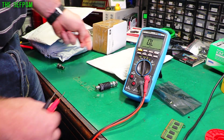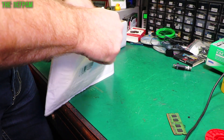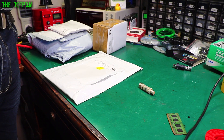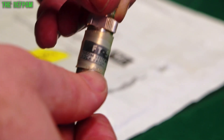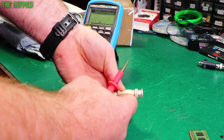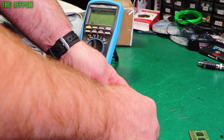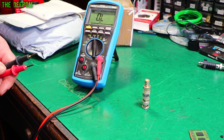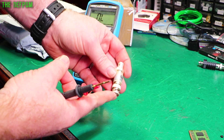So that's nice — it's looking good, nothing wrong with it at least. Interestingly, it's exactly the same packaging — I think it's from the same person. This is another 50 ohm terminator, this one rated at 2 watts — Elcom Systems. Don't know who they are; it's got some details around the bottom. Let me get the multimeter back out. Checking for isolation first: this one is not isolated — it's straight through. Center to the shield on the outside: 49.5 ohms. So yeah, that's good, looks fine. Excellent — got two high quality loads. You can see it's got a silver ring — this is actually silver-plated brass, I think. Definitely silver plate anyway — I recognise that. It's nice.